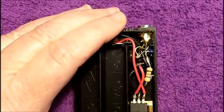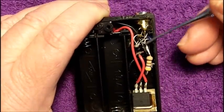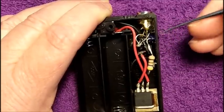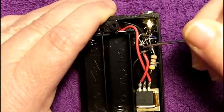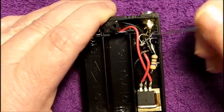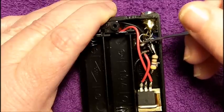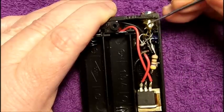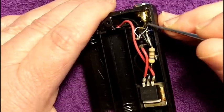Let's take a look at this mod. Let me turn that meter off. See these bare wires? Total no-no. There's no insulation on any of these wires. This wire right here comes off the LED, goes to the side of the switch, then the modder just sort of wrapped it around this leg of the switch and pushed the remainder aside — just pushed it out of the way. And where it's pushed out of the way, it goes directly across this piece of bare wire which is the ground for the atomizer connector. This is positive, this is negative, and right there is a dead short between positive and negative.